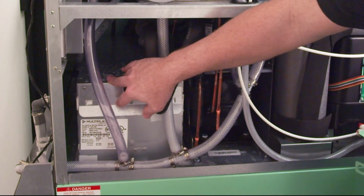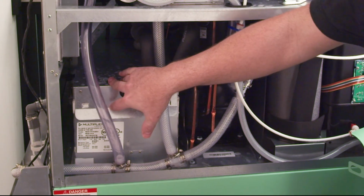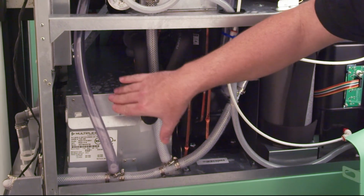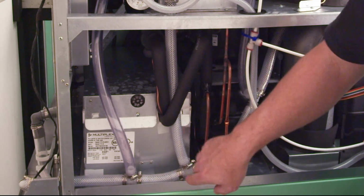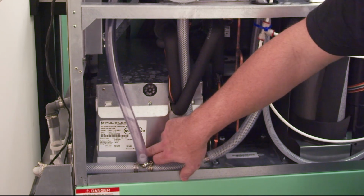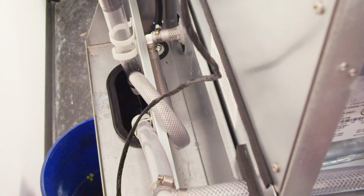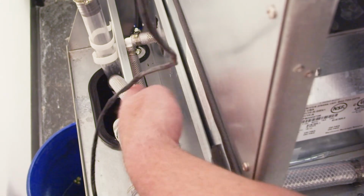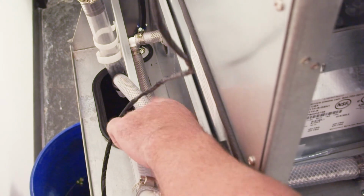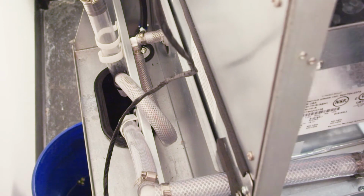Like normal refrigerators everywhere, they all have an evaporator. They have a normal defrost cycle where, as they get dropped down to a certain temperature, they'll melt off. The water then collects in a pan in the bottom of this evaporator. There's a drain line in this evaporator pan that then goes out the back. So in the back, the evaporator drains through this center drain here. It loops to keep an airlock on it, and then runs into that trough in there.